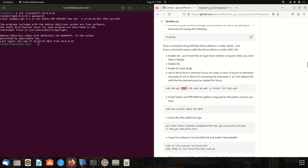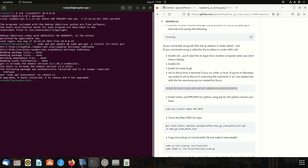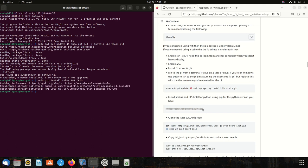I've already updated my Raspberry Pi, but we'll go through it so you can see what to do — just paste it in and it'll check, and in my case it'll say it's already installed. You're going to need to use pip, the Python package manager, to install smbus and rpi.gpio. This is in order to use the I2C bus so you can use the GPIO pins on your Raspberry Pi to physically connect to the iMac G3. You may have several versions of Python installed, so you can replace pip with pip2 or pip3 depending on which version you're using.